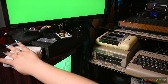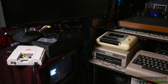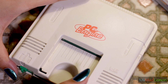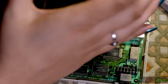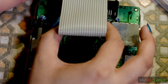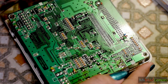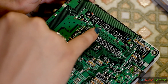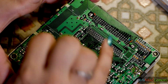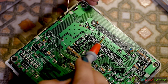If I put a HuCard in, it comes up fine. I just spoke to Todd from Todd's Nerd Cave, who is a member of Terra Onion, and he pointed me to a thread where somebody else had the same issue. Someone mentioned that when you have a board without the shielding, not all the grounds are connected. These two points here actually need ground but are not connected — the shielding would normally have dealt with that. Let me test them with a meter. There needs to be a ground connection between these points.